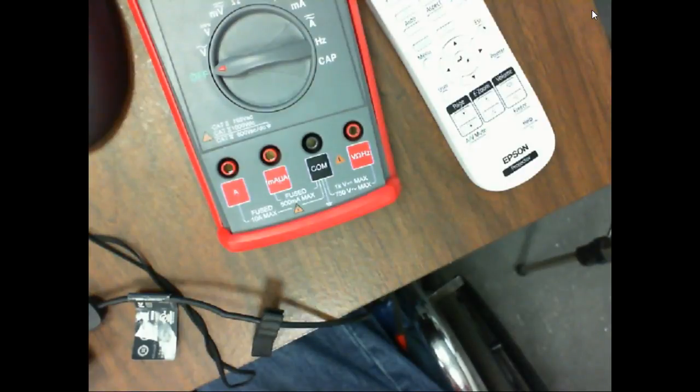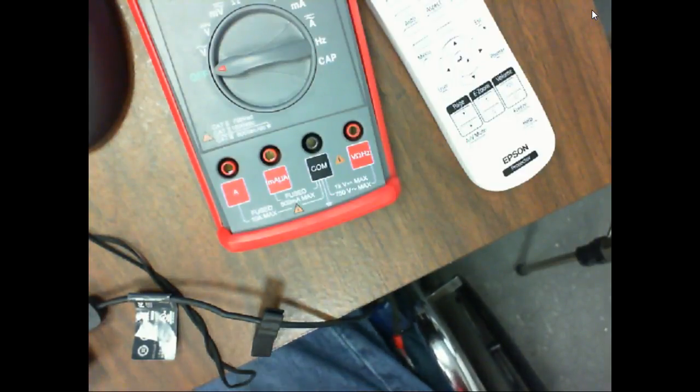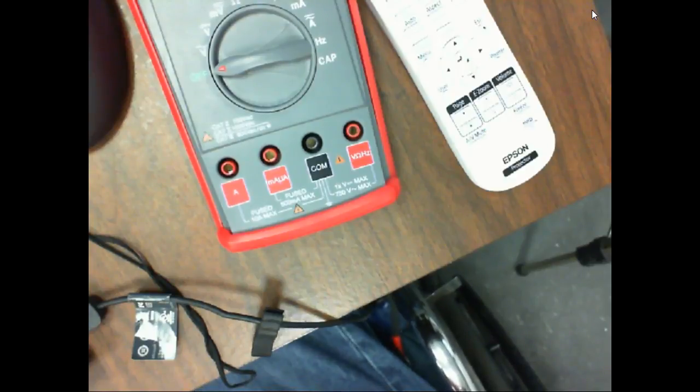Now, all these should be either IEC rated, which is the International Electrotechnical Commission, or they should be UL rated. So don't go out and buy a little cheap meter that's got Cat 3 on it. You know what these organizations are? They're basically non-profit organizations. Companies pay UL to test their equipment, and UL certifies that it does what the manufacturer says it will do. So if it has a UL stamp, you know it meets or exceeds the manufacturer's specifications, which is also what IEC does. It's just that UL is basically here in the United States, and IEC is an international standard.